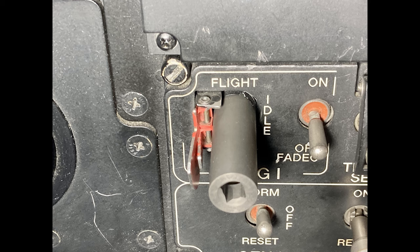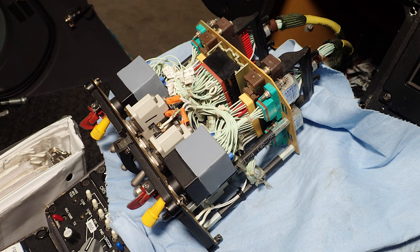So you have your switch disconnected from the switching unit, but it's hanging there with those 20 wires. I think it's actually 21 wires. I think three or four of them are filled with those blanking pins. So it's just hanging there loose enough where you can get access to each wire one at a time. Grab your new switch, put it right next to it, and do one at a time.